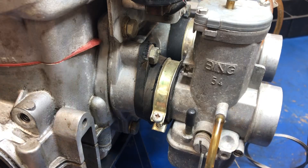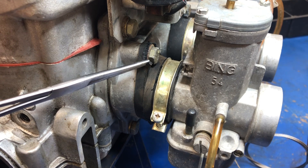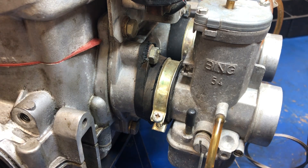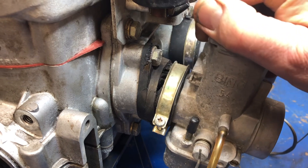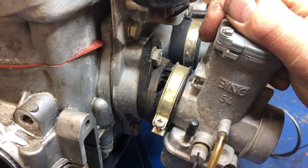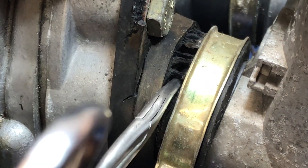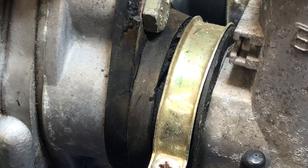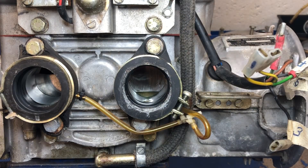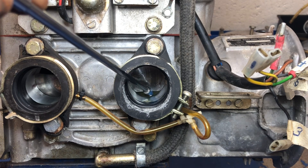On visual examination, the carburetor socket is a little crusty at the top. When we flex it one way it's okay, but the other way — look at that — it's wide open, you can go right inside. These are the most rotted carburetor sockets I've ever seen to date. With the carburetors removed, there's some fluid down here — and it's not oil, that's water.